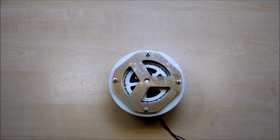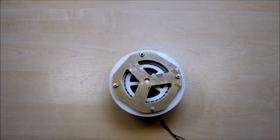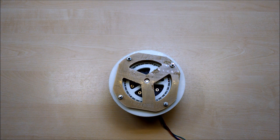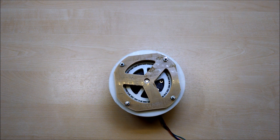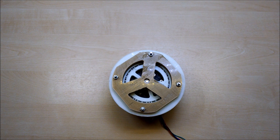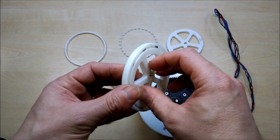This is an elliptical strain wave generator with proper ball bearings inside and it's around a 45 to 1 ratio on the gear. I'll turn it now for you so you can get a feeling for how it works. You can immediately hear that my 3D printed ball bearing races are a poor substitute for nice hard metal ones, and unfortunately, although there's a nice looking motion to this, sadly it doesn't translate into usable torque. Here's the elliptical strain wave generator - and it's not smooth.